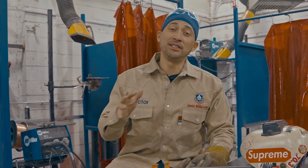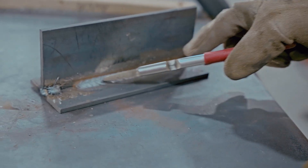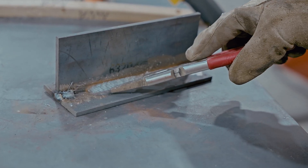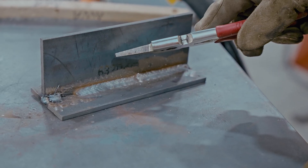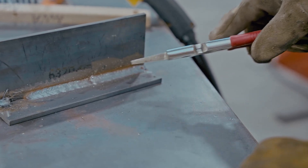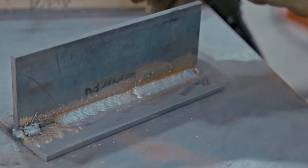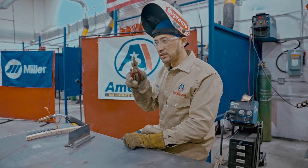Please give me a huge favor — like, comment, and subscribe. It really helps out the channel. As you can see, the toe of this weld bead is where it actually fuses into the bottom plate and the top plate — nicely blended in. I have a nice heat and nice consistency. The move I'm making is a cursive E — making an E over and over, overlapping back into the puddle, dragging it out, overlapping back into the puddle.